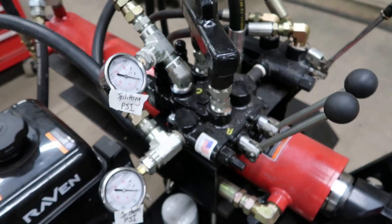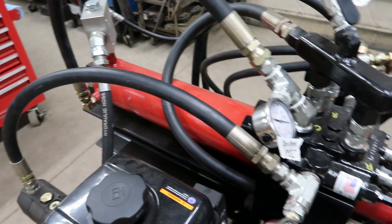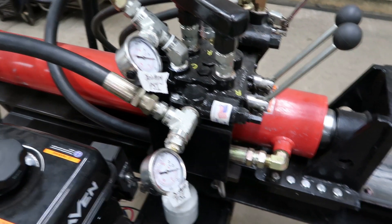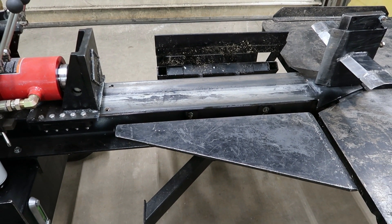The pressure differential was 500 PSI when it's trying to ram it back through the valve body, versus 200 to 250 PSI when it's sending it through the dump valve — or most of it through the dump valve; maybe some is still going back through the valve body. And I'm picking up maybe one to one and a half seconds of retract speed.